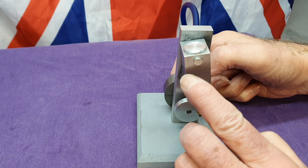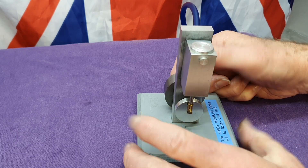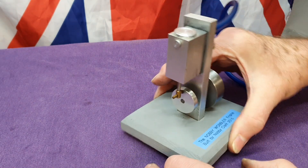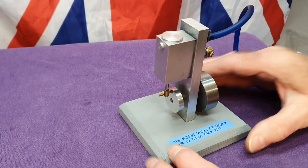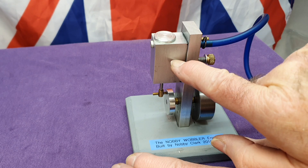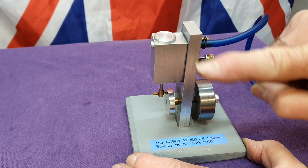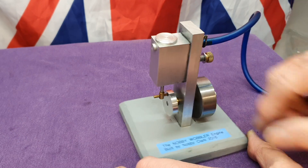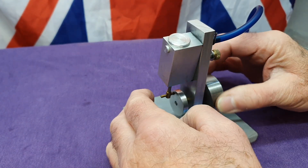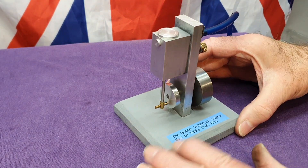Then you cap this end off — I made a tiny aluminium plug and glued it in with super glue. That's the easiest way of aligning your air input and exhaust output. The important thing when you build these is that when you put the little threaded rod into the cylinder you get it absolutely straight — absolutely square to the back of the cylinder. If you don't, the face here and the back face of the cylinder will not meet and give you a good seal. That's the one thing that is very very important.